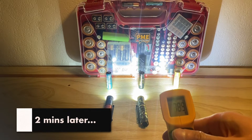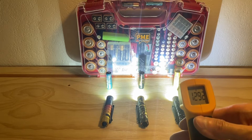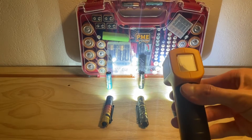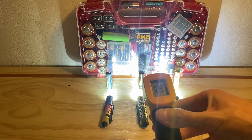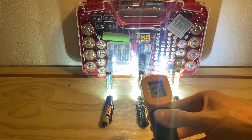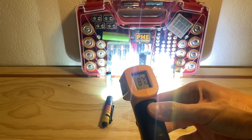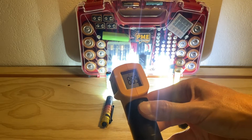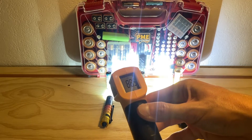Let's get another read — low 140s. Definitely getting hot here with the lithium ion. On the lithium iron phosphate, we're getting to 109, 110 — I'll call it 110. And then the i5R 2.4 volt battery is definitely still staying pretty cool, brushing up right against 90. That's just kind of warm to the touch. No problem there.